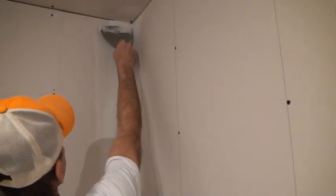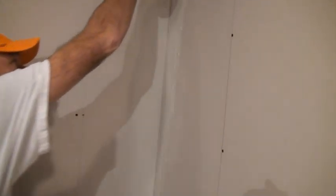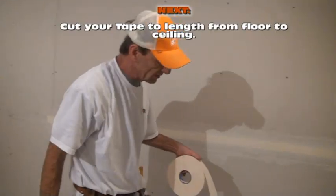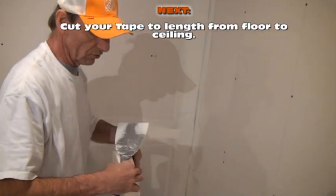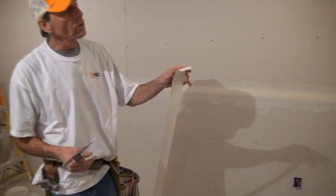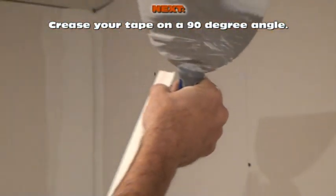You don't even need two inches — an inch and a half out each side is plenty. All this extra out here is leftover; you can get it off now or after you tape. Take your same flat tape, roll it out to length — tape rips on length. Trick number two: when you go into a corner, the tape is pre-creased, so you're going to fold it. Just fold it about three feet down for starters.